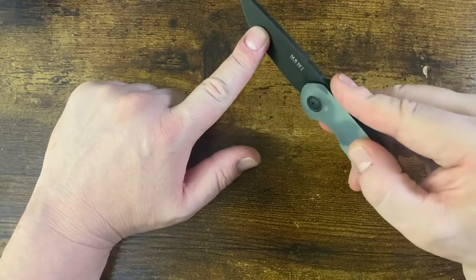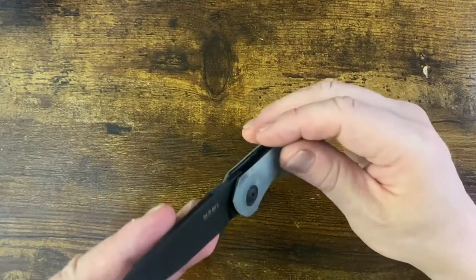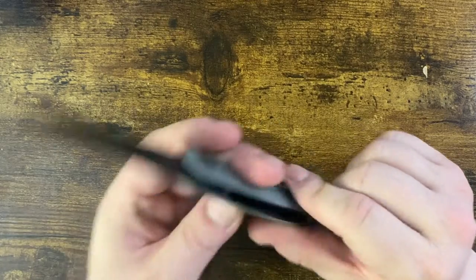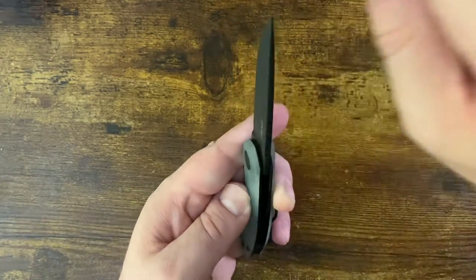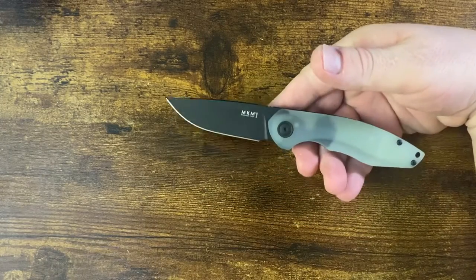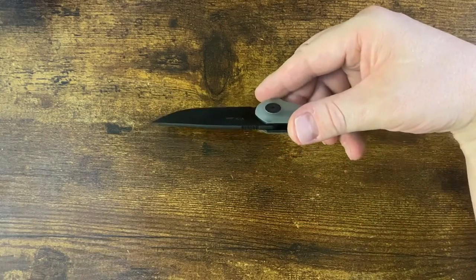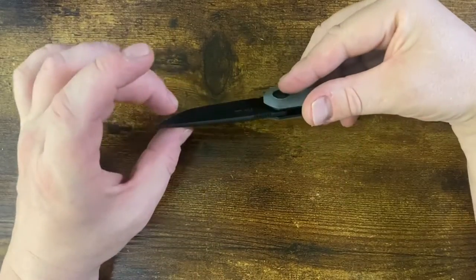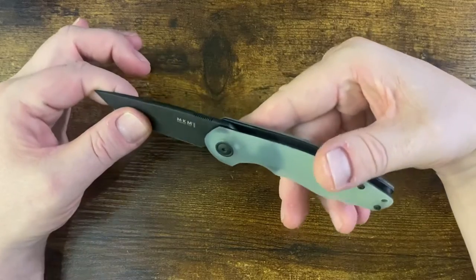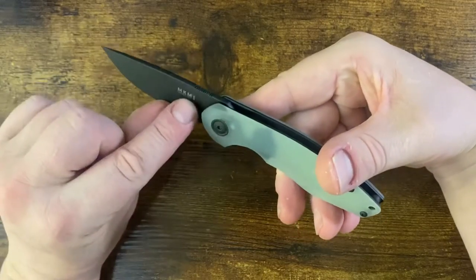I thought it might be a saber. See if I can get some light in there. But it really comes off. It starts to taper to a distal taper with that full flat grind all the way down, which is nice. A distal taper really helps a lot of things. It's not huge, but there's the really big taper, and then it's just light. It looks to me like that is a full flat grind. It might be a partial saber. You know, it's hard to tell.